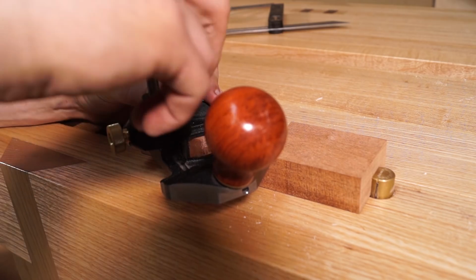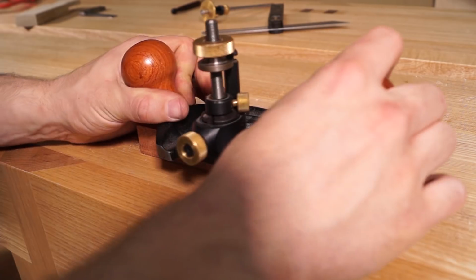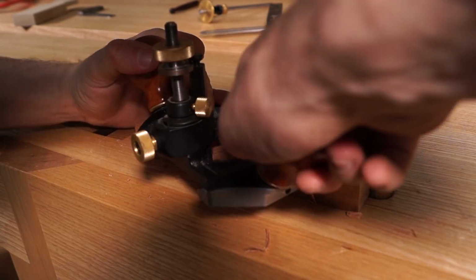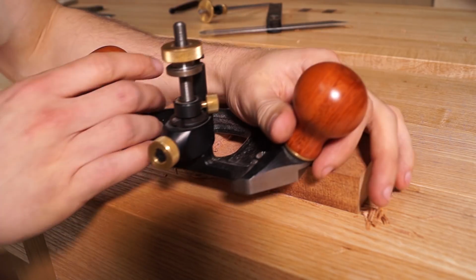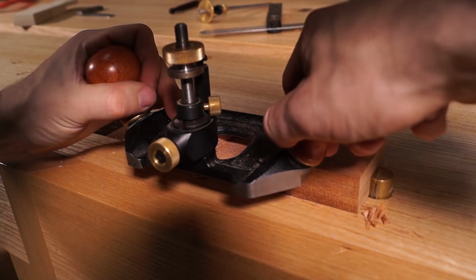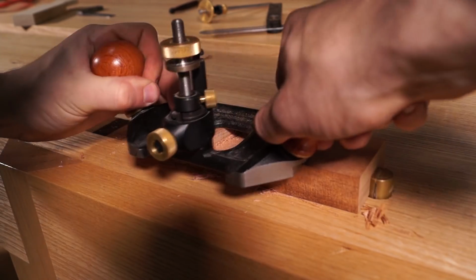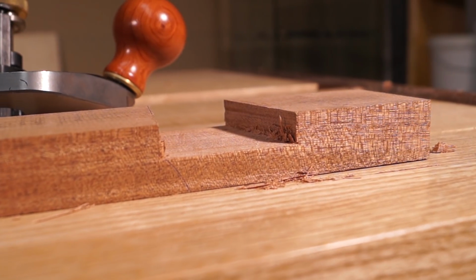So I'm going to bring the blade up, so we're taking off the peaks to start with. So skim that through, and we're just going to keep lowering this blade until I eventually hit that baseline. That is pretty much at the baseline. What I might do is just that little trick where I loosen this, tighten it again, and let that blade naturally drop a bit. There we go. Taking out one final pass all the way around. I reckon that's pretty spot on the bottom now.